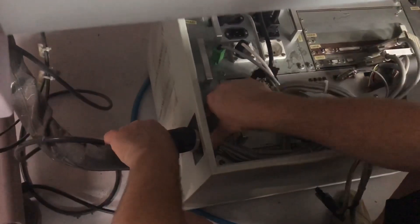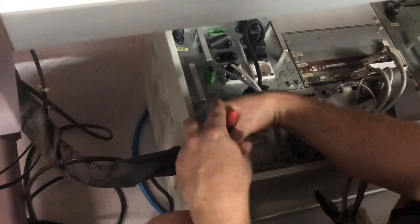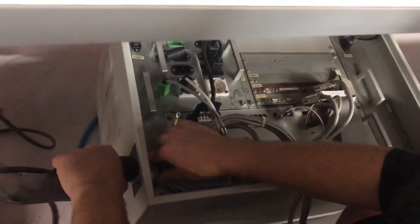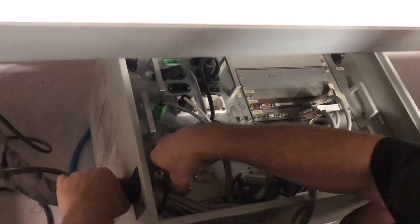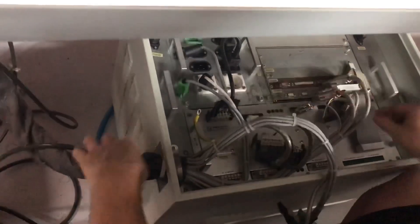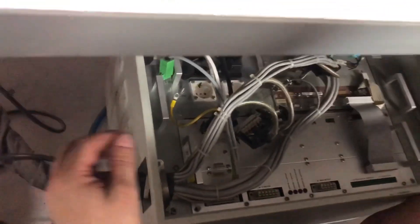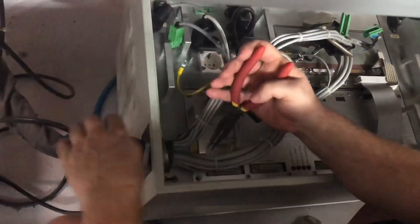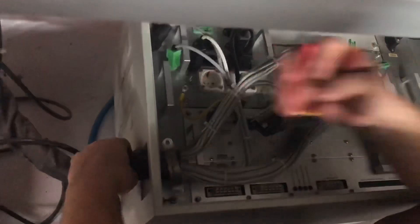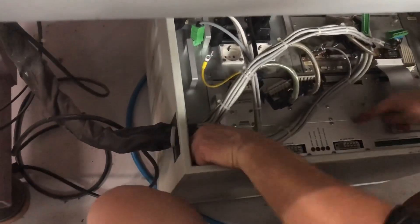We saw that we had a blowing fuse there as well. So there's quite a distinct separation between two sides of the power supply — one side being the main drive, and then a distribution across into the other motor drives. I was fairly confident by what we were seeing that the faults were in different parts of the two drives. So that's where swapping them over led to the outcome we wanted. And they were segmented quite nicely in the guts — as you can see there's a gap in the board just here.